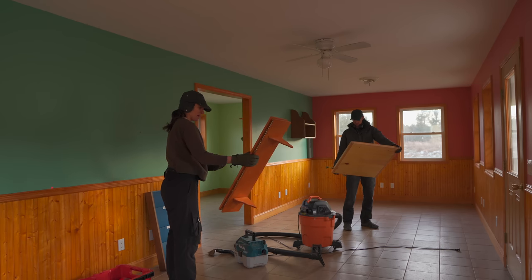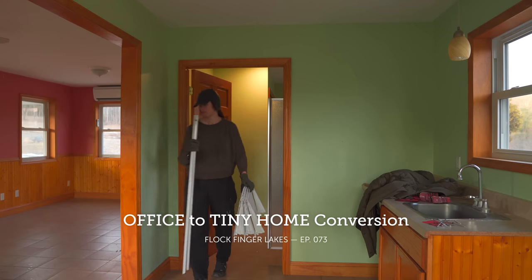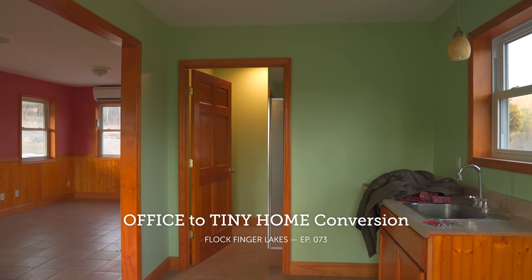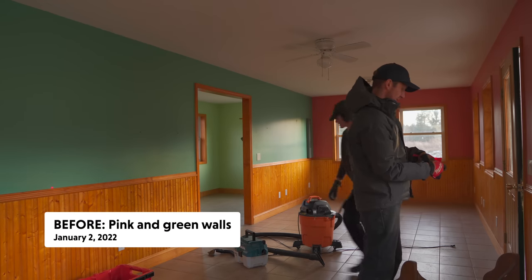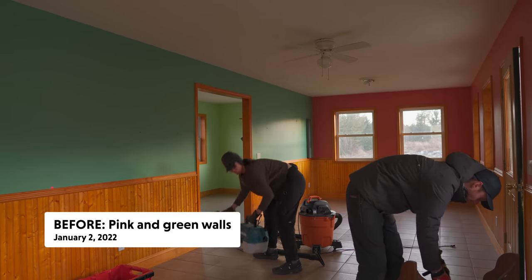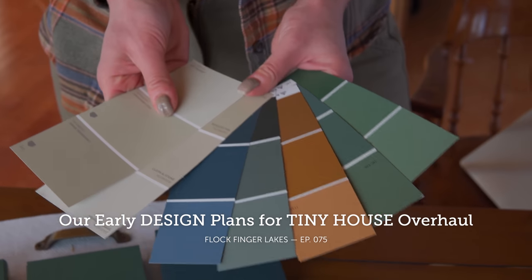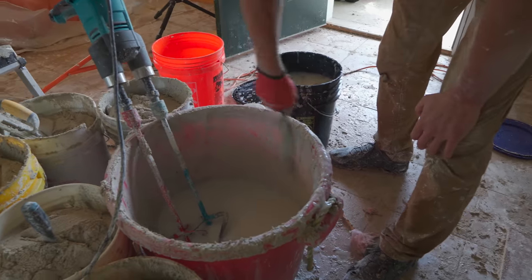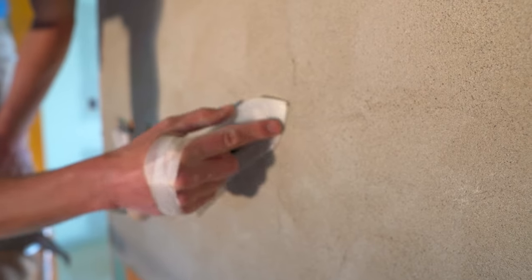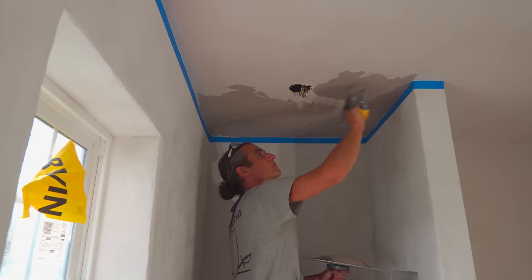We wanted to give you an update on the progress of the interior of the Meadow Home. If you recall from earlier tours, this building used to be an old nursery office that was painted in very, well, let's say bold shades of fruit punch, mint, and pistachio greens. We decided that we would not only soften the colors of the home with a more muted color palette, but also utilize more natural ways of coloring and texturizing the walls, namely with a clay plaster in the main rooms and then a TADELAKT lime and limestone plaster in the bathroom area.